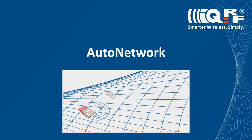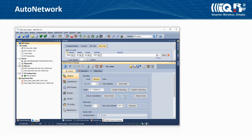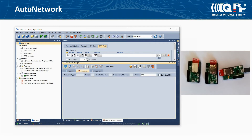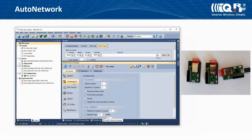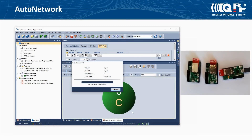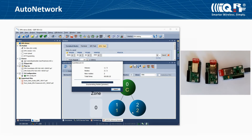The third method of adding devices is Auto Network, available in IQRF IDE since version 4.52. First, clear all bonds to prepare nodes for bonding. You don't need any custom DPA handler for this functionality. All devices must have the same access password as the coordinator. In IQMesh Network Manager, find Auto Network and set initial parameters like number of retries, discovery power, maximum number of waves, empty waves, or network size. You can use default parameters, then click Start. The process of bonding new nodes and their discovery will run automatically.